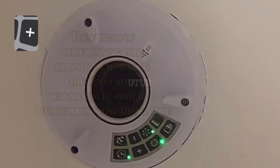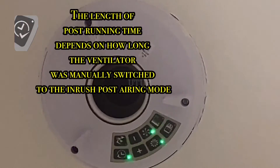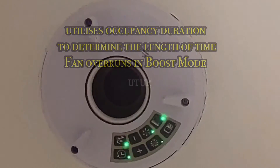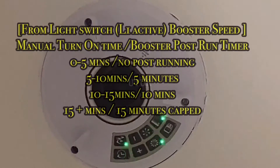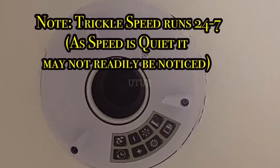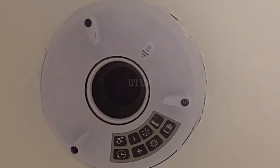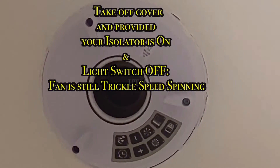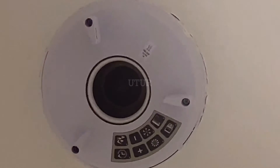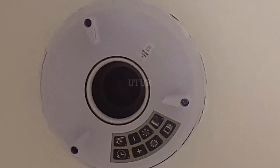The timer smart provides a way of ensuring that ventilation is delivered effectively to your home. It utilises the duration of occupancy — for example, in your bathroom — to determine the length of time the fan overruns in boost mode, as opposed to a preset generic time of, say, 15 to 20 minutes. So if you spend 10 minutes in the bathroom, it will overrun on boost for another 10 minutes, helping to reduce nuisance noise, unnecessary heat loss, and keeping energy performance as low as possible.